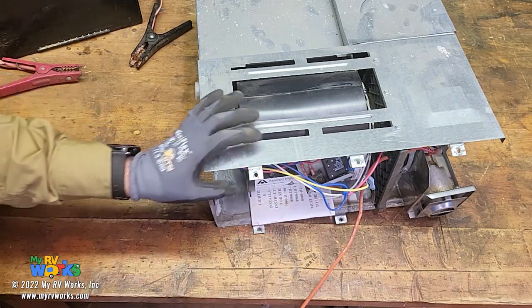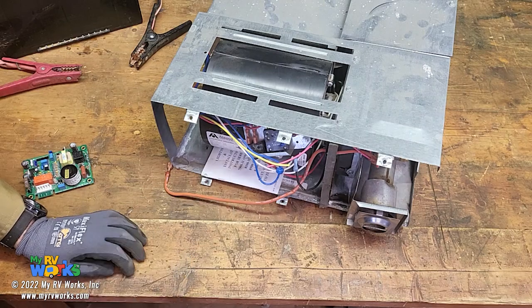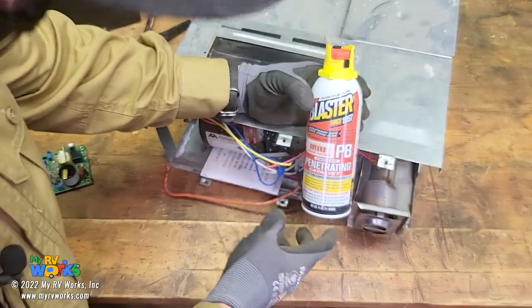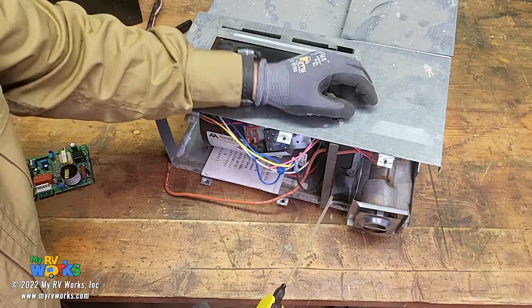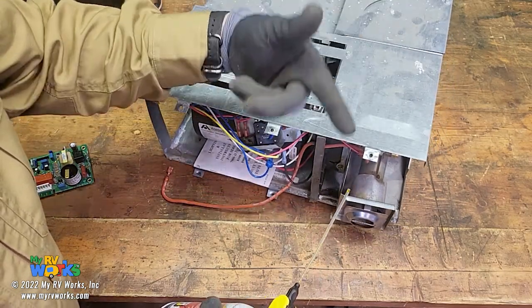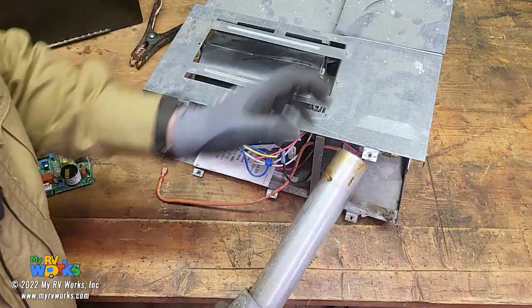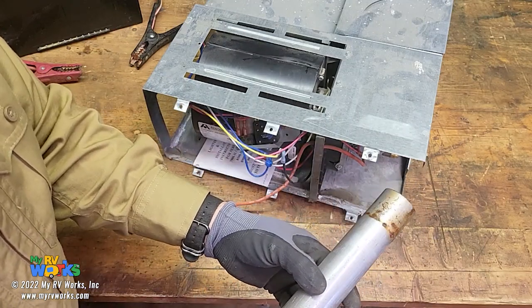Your next question was about having a hard time getting your burner out. Let me show you how I sometimes get those stubborn ones out. This is not a commercial, but I will make a link to this product. I've used it for years - it's great, apparently people have been using it since 1957. I don't make any commissions, but it's a really great product. You get in there and let this soak in. Interestingly, when I grabbed this furnace I couldn't get this out either. I stood it up on end, squirted it on there, let it sit for about 10 to 15 minutes, then took some channel locks and wiggle wiggle wiggle - and I was able to get it right out. You can see where the rust was really embedded, but that product does a great job breaking through and helping to get it out.